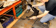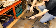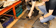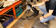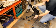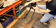And then once it's welded on with the slug, of course, to make it strong, we'll have to remake these engine mounts as required. I think these need to go further up, so if we actually do cut it there, if we can make some in flat plate, we can actually bring them up and use it over the join. Yes, which will give some strength. Which then will make it a hell of a lot stronger. Okay, so that's kind of how it's going to look.